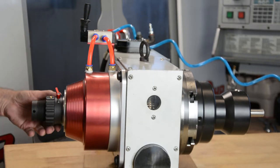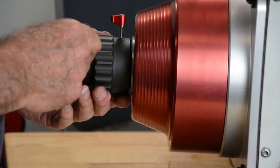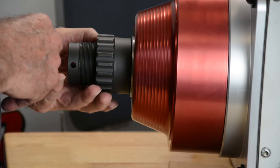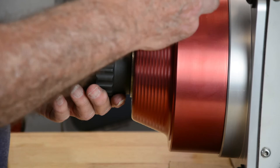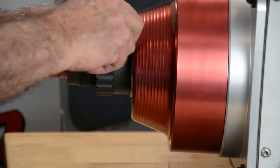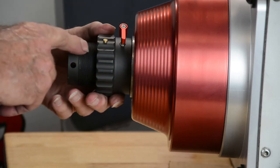okay, something I want to point out is about the collet adjustment nut in the rear. This is the collet adjustment nut. Once the whole thing is set up, if you rotate this up against the washer, this collet adjustment nut will take all the extra play out of the collet as it's moving back and forth. It won't move so far. And there's a small brass pad. Here it is right here. It's actually in the hole where the lever screw tightens up on the threads.